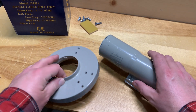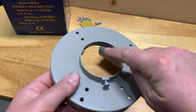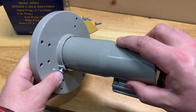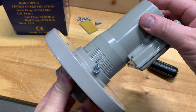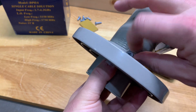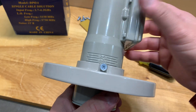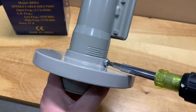In terms of assembly and setup, use one of the bolts to install it in the scalar ring — there's only one bolt that holds it in place, but there are raised spots along with the bolt that keep the LNB centered in the ring. Put the bolt in so it's protruding just a little so that when you put the LNB in, it holds it but doesn't allow it to move around too much. Using the index marks, get it set up on the mark you want — my other one was set at 36, so I'll put this there. Tighten the bolt by hand, then turn the LNB around and get those marks even so you know the LNB is set up evenly inside the ring. Keep in mind you may have to adjust this once it's up on the dish.